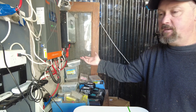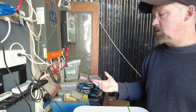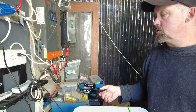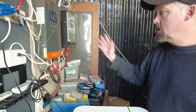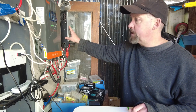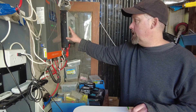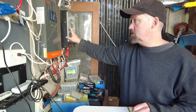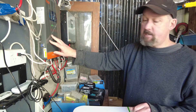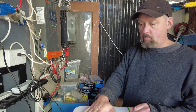It's got two fans and can run on the other one. It never had much of a load anyway - probably two kilowatts might go out of it occasionally, but that'd be quite rare. Some of my tools - drills and saws - might push it for 2.5 out of its 3 kilowatts, but it handled it. I actually overloaded this one and gave it more than its 40-amp max for a stage with extra panels plugged in. I did parallel-series because it drops the amps and watts down together. So $350 for the cheap one, about $800 for the new one, and the Growatt is about $900 - which is going back because it's faulty.